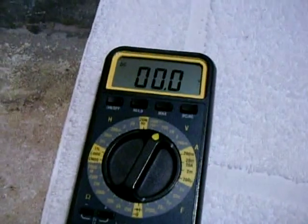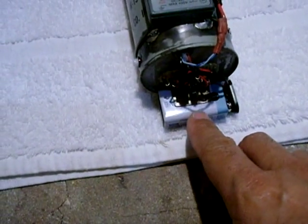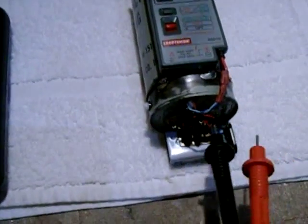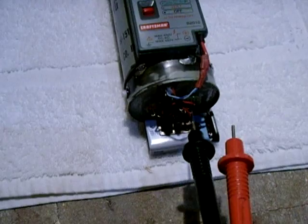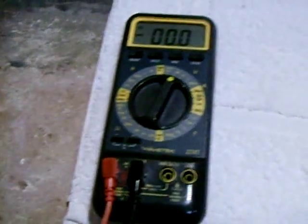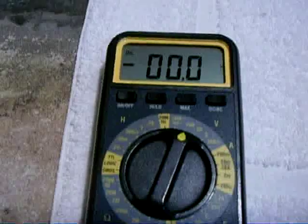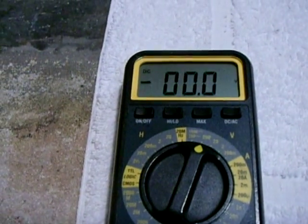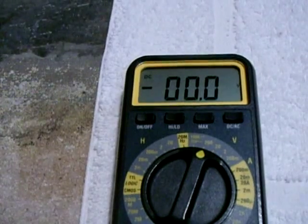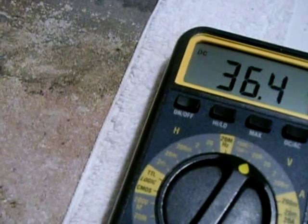The can is charged to roughly 50 volts. The battery I'm using is a little run down — it's around 8 volts right now. The current output of this 50-volt board is in microamps, so even though the digital multimeter uses 10 megaohms for voltage testing it's still going to draw down the voltage of this board. When I first connect it, it shows around 43 to 44. There we go — 42 — and it's going to weigh it down, bringing it down.